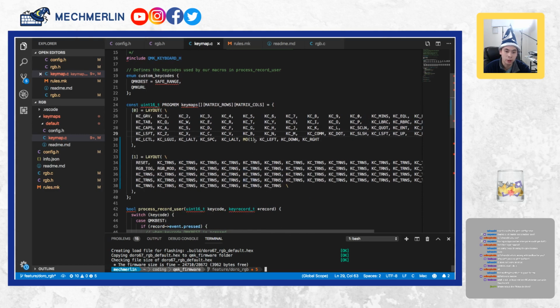I have set your function key immediately to the left of left arrow. If you hold it and press escape, you drop into bootloader mode. If you hold it and press tab, that toggles your RGB. If you hold it and press Q, that cycles through RGB mode. This should at least get you a fully working key map tonight, so you don't have to type exclamation point, or when you're trying to write your email, you're not gonna be,